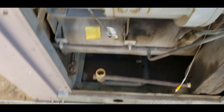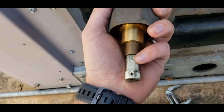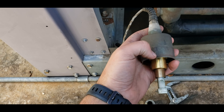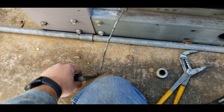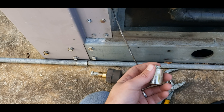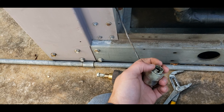Normally what you would do is if you were questioning whether or not this was any good, you'd have to recover the whole system down, but you could pull this out and inspect it and then actuate it. So whenever I was testing it, I could still hear the motor actuating in and out, but it wasn't actually changing anything and my evaporator kept pumping down on me.